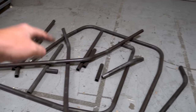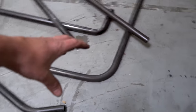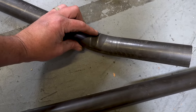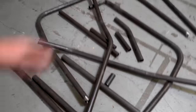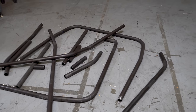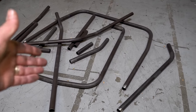That's why there's a big pile of chromoly over here — either it wasn't bent enough, wasn't bent in the correct sequence, or I had issues learning how to bend again. The harshest reality I've had to face on this build — a lot of people wondered why it took me so long to make this video. I haven't done this in two years; I've been playing businessman and making welding videos. I didn't tighten the clamp block down tight enough and it slipped and kinked the tube. This scrap pile has basically cost me about $400 worth of chromoly.